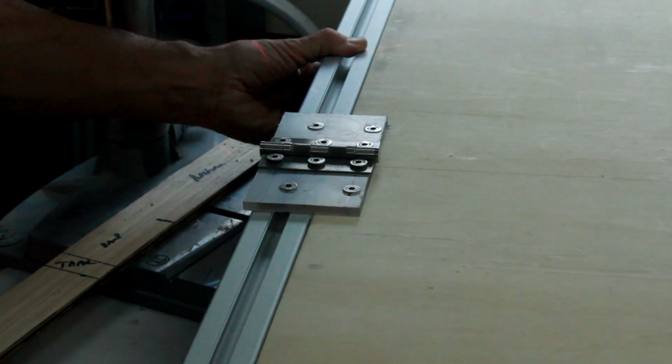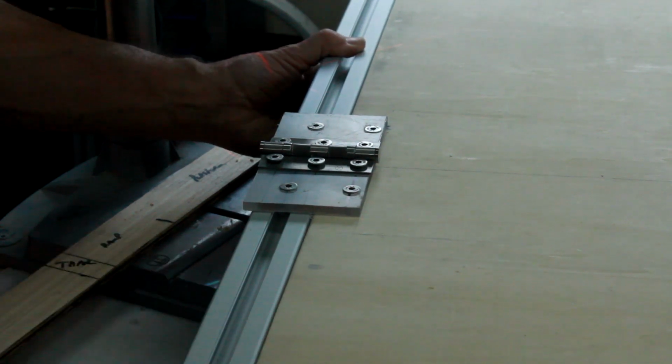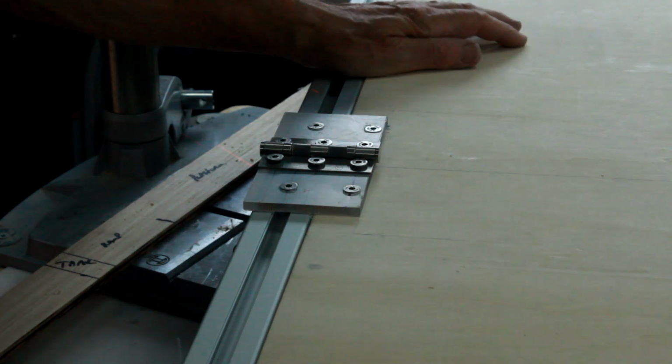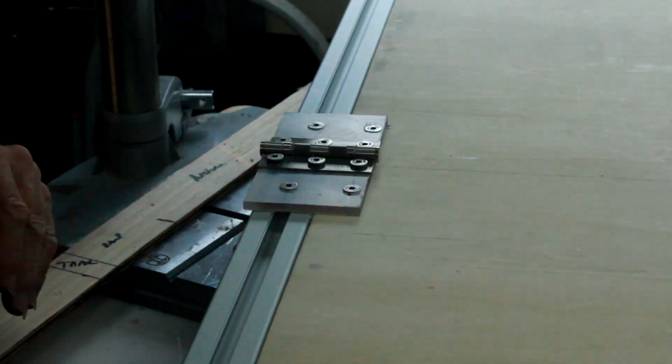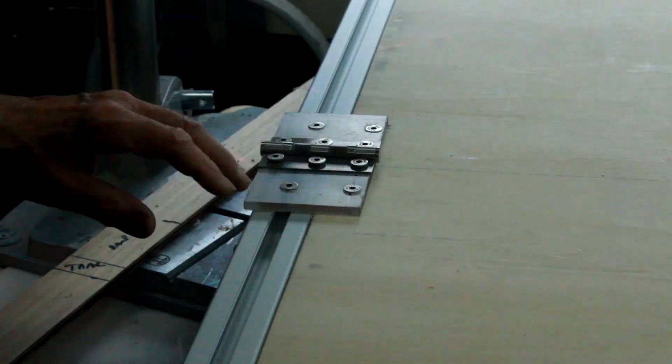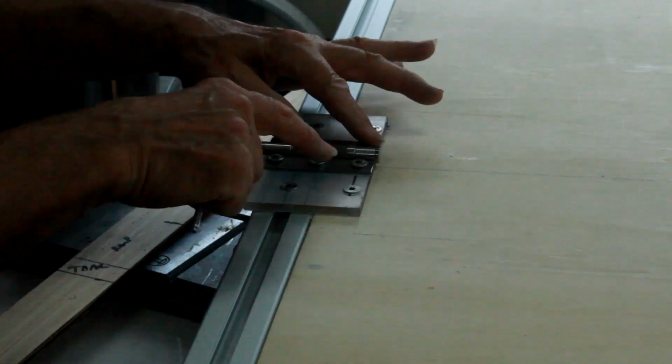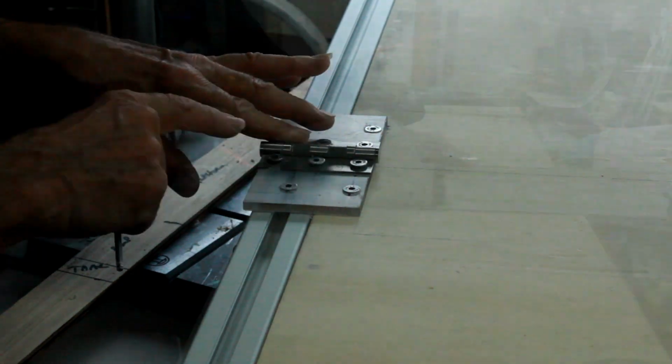The actual rails are bolted on solidly onto the side with 3 8mm bolts in each half. So I think if it's going to fail, there's nothing more I could do about it, because that is engineering overkill to a fairly high extent when you think a normal internal door is hung with 2 of those.